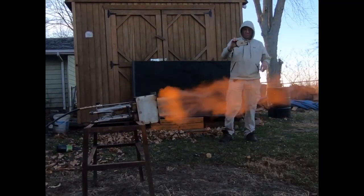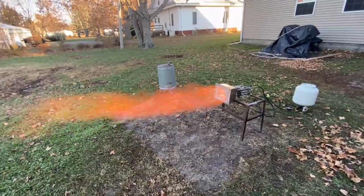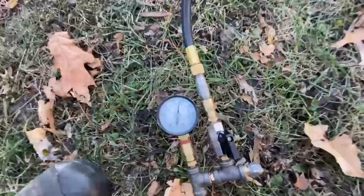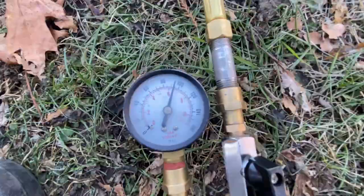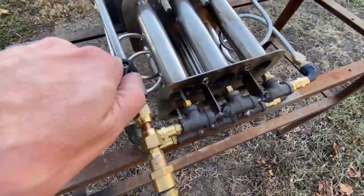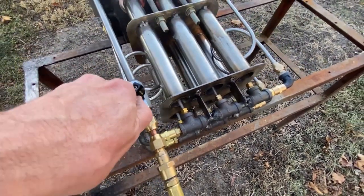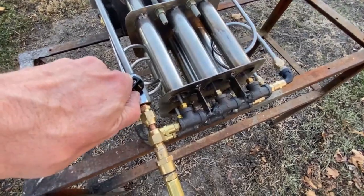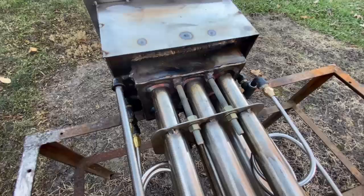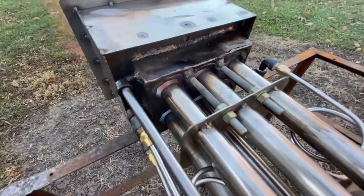I couldn't be happier with how well this thing burns. I was worried it was going to be a big, stupid, lazy flame, but even at a right angle it's a very stiff flame and it's almost 100% vertical. We're not losing hardly any propane pressure, and anyone who's ever used one of those weed burners knows that when it's this cold outside you cannot maintain bottle pressure. We've got so much pressure here we're spraying out liquid propane, so we are overworking the vaporizer just a little bit.